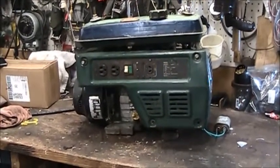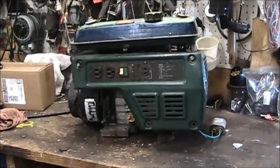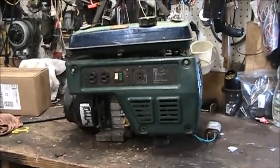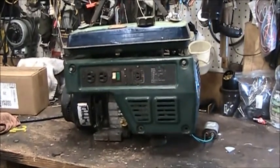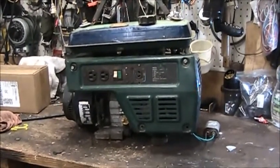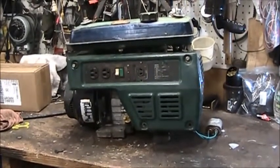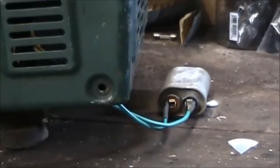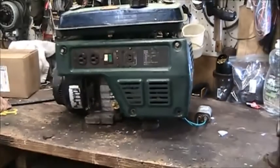There's no documentation for this generator out there anywhere, so I'm going to be making documentation for it. I do have it running. It is a capacitor regulator, and what I'm finding out is the capacitor is usually what's burned out — they've got a finite life. What I did is I just substituted a start capacitor off a furnace motor.